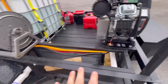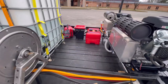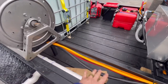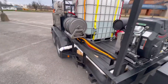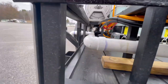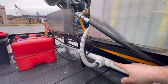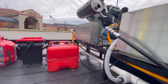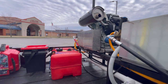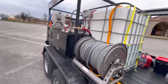This space right here is empty for the moment because there will be a water-fed hose reel here. It's already got the mount — we just need to get it mounted, but it's actually too small to fit so we have to weld another plate in. The plumbing is all run with two-inch PVC tucked under — it's really clean. We come off with a tee, reduce down to one inch over here, then off that elbow reduce to one inch for the machine. I have no problems with water supply feeding it with the two-inch dump valve right here.